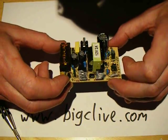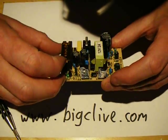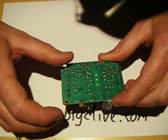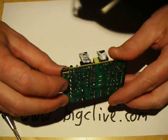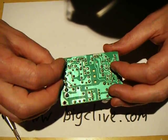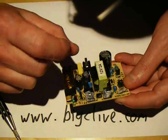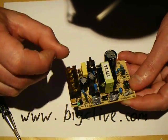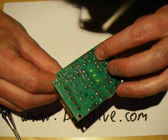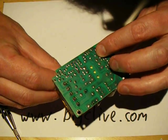Apart from the filtering input, it also seems to have a choke on the output. On the output side, the transformer goes through — that's a pair of diodes, not a bridge rectifier, which have the two outer pins common. That's feeding and charging a capacitor, and between that capacitor and the next capacitor is a choke, which will provide good filtering on the DC side as well. It's nice to see that.